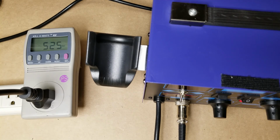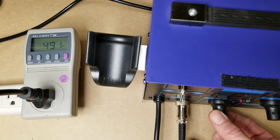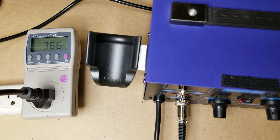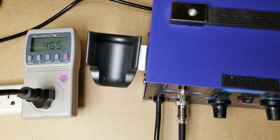There it goes. So let's turn the fan down. And without as much need to produce heat across those coils, it should heat up and the power should go down even more. Anyhow, I'm going to turn the heat back down to 212. Turn the fan up all the way. And as you can see, it's cooling off, 11.5 watts. 11.3. With the fan on low, about 7.5 watts.